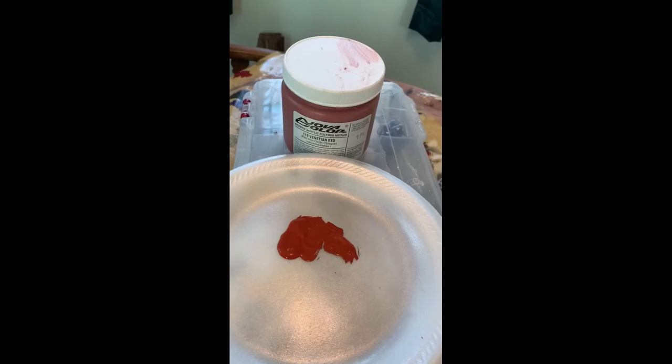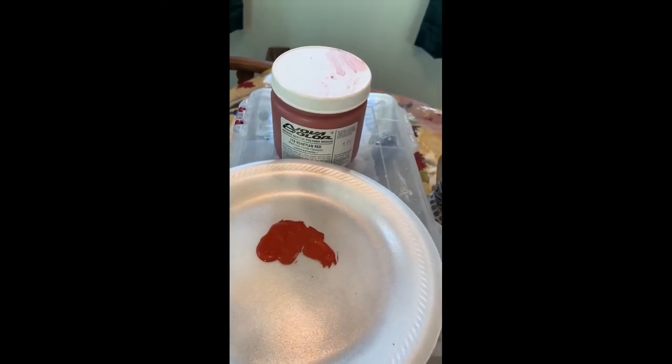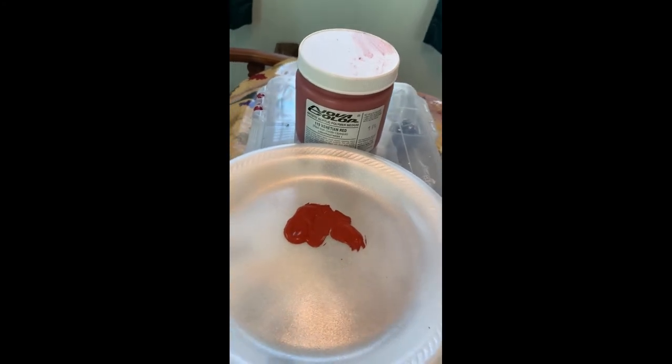And this is the same concept if you were distressing your kitchen cabinets. If you decided, I could paint my kitchen cabinets, but I want that distressed look, it's as simple as this. I mean, granted, there are other tricks. But generally this is what it is. It's sanding back, and then you have to clear coat it over that. The second thing is I'm going to show you how to do a positive application to get an interesting, distressed kind of look.